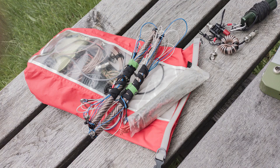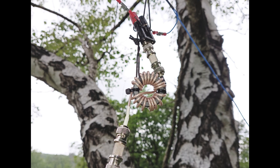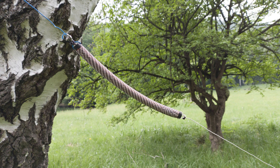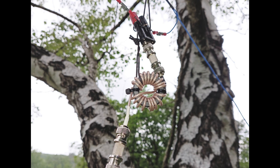You will see it here. There is this adapter on the top and the choke. I disconnected and connected the choke in between the antenna and the coax feed line. Here you see the antenna — the shortened dipole with the coil. We got the nearly perfect SWR. Again the current choke with this BNC to banana plug adapter.